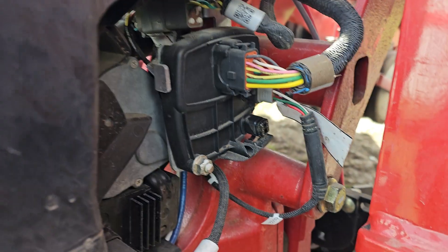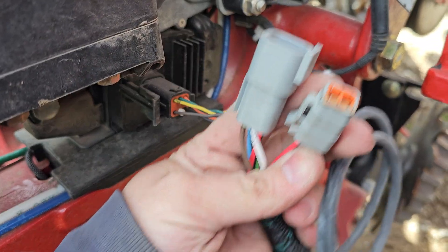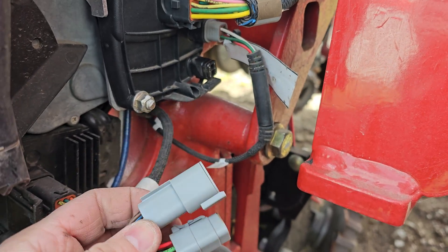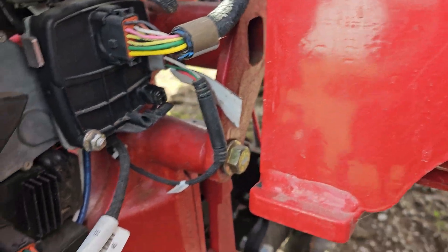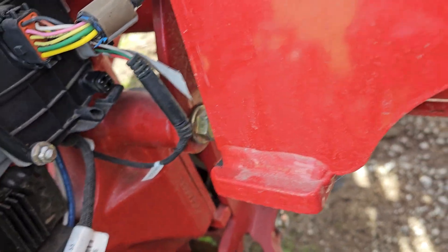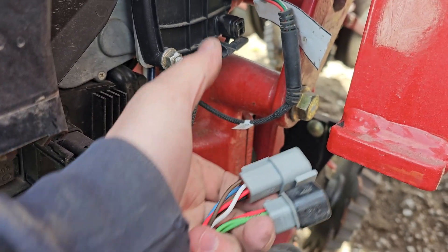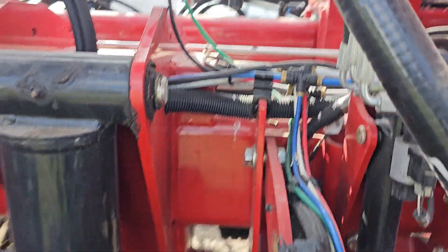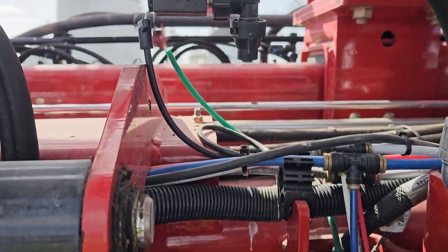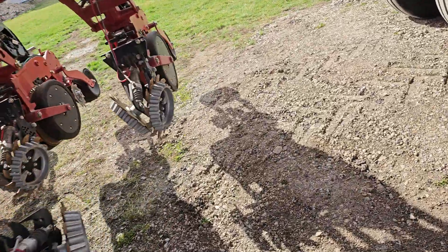In this case, since I've got an extension cable on the FlowSense, they made a Y-adapter so that you don't take up the port and you can still plug in an implement switch or anything else. I go ahead and take the cap they gave us on the SRM and just put it on that extra port. The extension cable will go from the plug there to here, and that's what gets us all the way up to the top so we can add our cables.